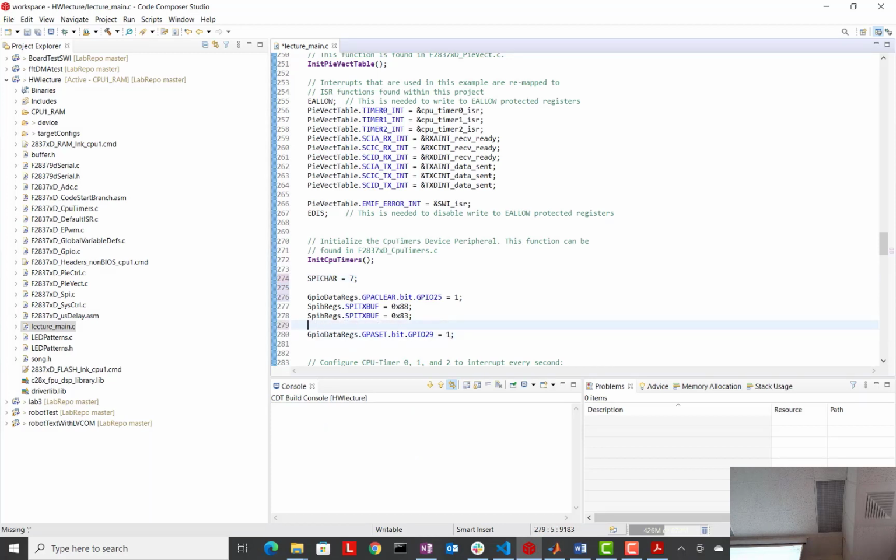Now what we've got to do is wait. Okay, what are we waiting for? What this says is, the receive FIFO status is what ST stands for. Because we're sending out 2 values on the FIFO, how many values are we going to receive in the receive FIFO? 2, right? Simple. So what we have to do here is wait for the receive FIFO status to be not equal to 2. When it is equal to 2, we know we've gotten 2 things. And because we're transmitting and receiving at the same time, we know also that our transmission is finished too.